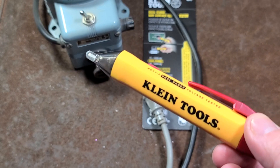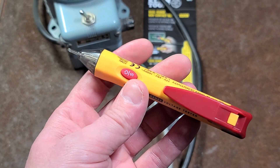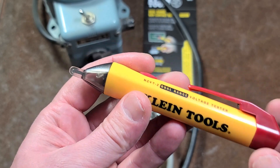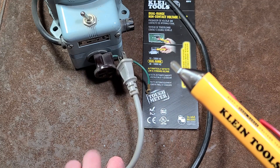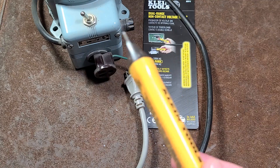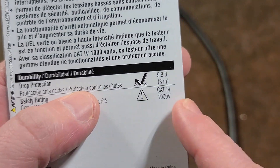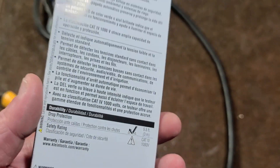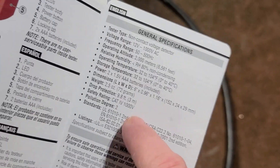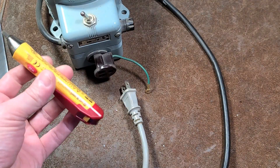This dual range from the Klein really is a next step, because you get one of these and it doesn't matter whether it's high or low voltage. If you're in a mixed environment — security cameras, security systems, all sorts of communication systems — you'll be working with both main power wires and low voltage wires. Something like this could be much more handy than having to carry two different pens. They advertise 10-foot drop protection. Looking in the manual, they offer 50 to 500 hertz, so it will certainly work in European countries at 50 hertz. 500 hertz is pretty good because most aircraft systems are at 400 hertz, so this even has applications in aircraft.